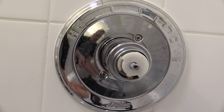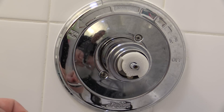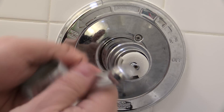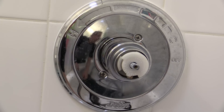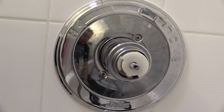It's a bit annoying just because of the way it is there. You're better off with a longer Allen key if you can, that reaches down better — this one had to keep resetting it into the thing. So if you've got a longer Allen key, that's a good thing. Make sure you close the drain and throw a towel down as well, just so that the set screw when it falls out doesn't chip the enamel. Also good just whenever you're working in the bathtub.